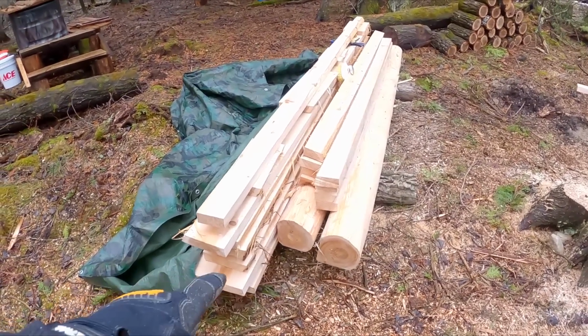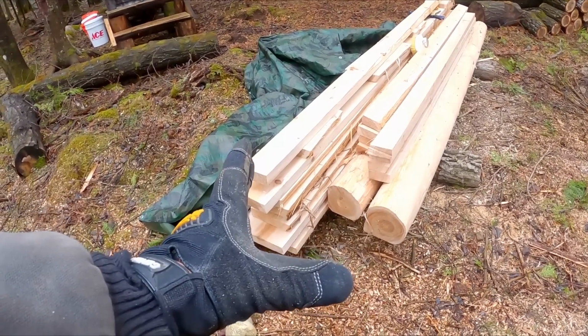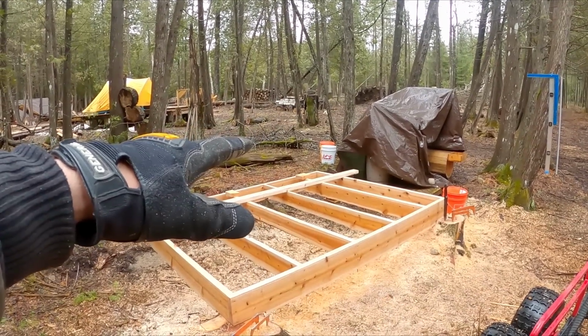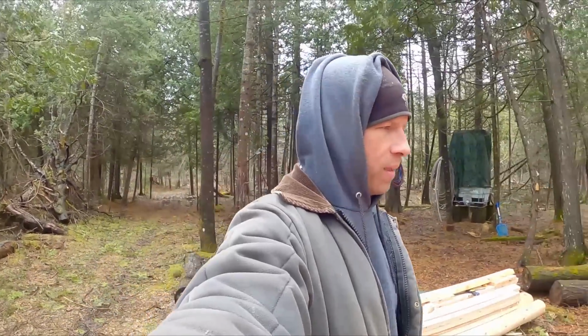So I'm thinking, take what I got under here, 7 or 8 boards that are 1.5 by some amount, probably at least 6 inches. I think I'm just going to lay all the rafters out for the roof, just see if I've got enough wood already made for it. And then whatever's left over, I can see if I can make into framing for the back wall. And if there's not enough, I'll just have to go over and mill a couple more logs up real quick.